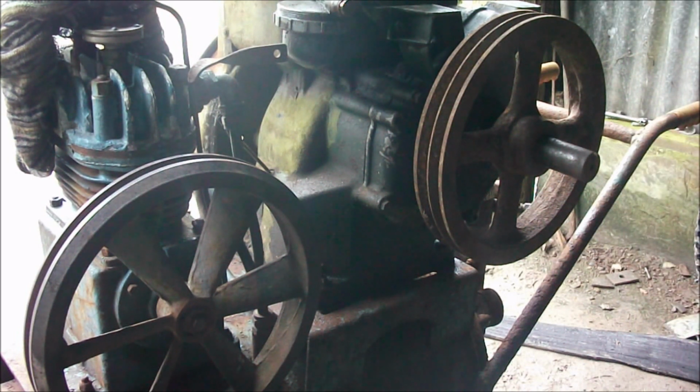It literally was a bit seized up. I freed it up. Maybe some rubbish in behind the cowling, and both valves were seized. So I just gave them a tap with a rubber mallet, unseized them, put a fuel tank on it. Didn't even need to bleed it. I just got a few swings. It was injected. It fired right away. So that shows how good these Listers really are. There's no smoke with this engine either, as you've seen. Anyway, I'll get the governor and then we'll carry on from there.